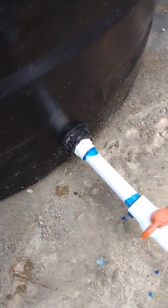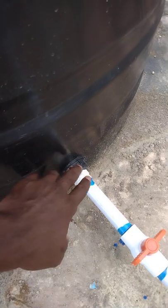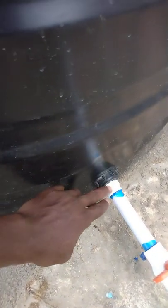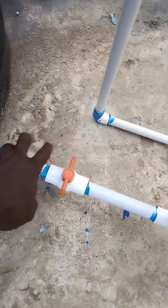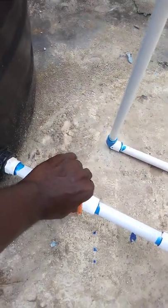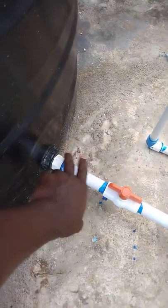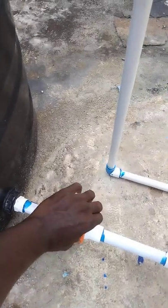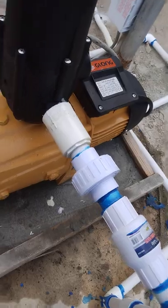The outlet is where the water comes from the tank to go to your house. We screw a male adapter inside the female section that is a built-on section to the tank. This male adapter is three-quarter inch because the outlet is three-quarter inch. After you put in the male adapter, you put a piece of pipe in it, then make sure you add a lock-off. Always ensure that you add a lock-off to where the water is coming from the tank, so if anything should go bad you can always turn it off.